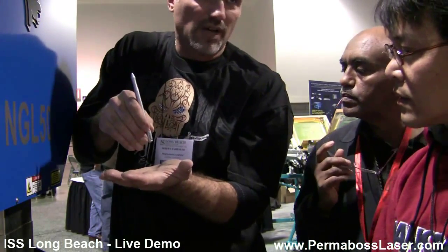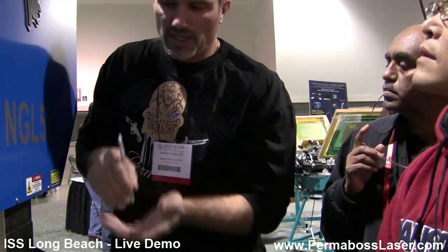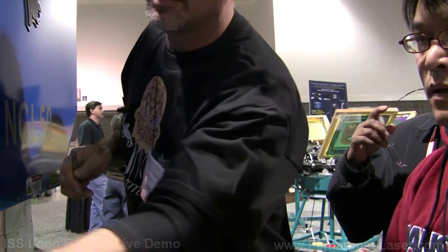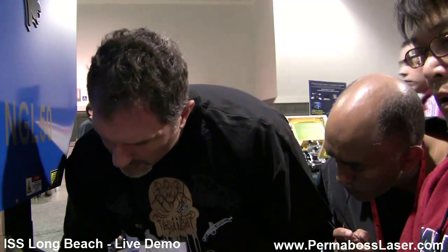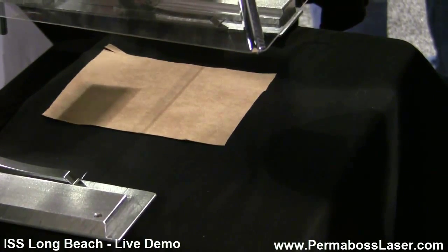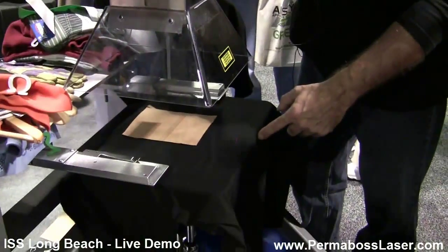Second thing is, you mentioned you have a plotter laser, right? Your plotter is actually a device mechanically moving like this, and when we have to do that etching, it takes a long period of time. Stephen, can you give me a piece of that suede, and can we etch something on the suede quickly? Don't turn it on for a sec. When you're etching on a plotter, you physically need to go like this over the whole way. But what I'm doing is, I'm a scanner. Watch down here, from a small movement, I have a large result. And that's the difference with a scanner.